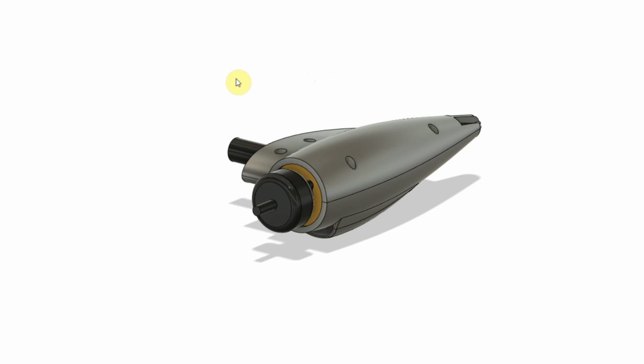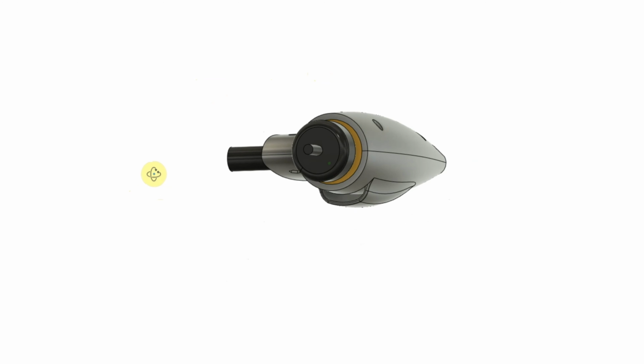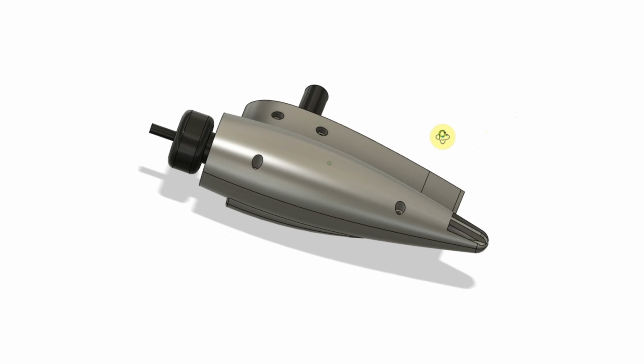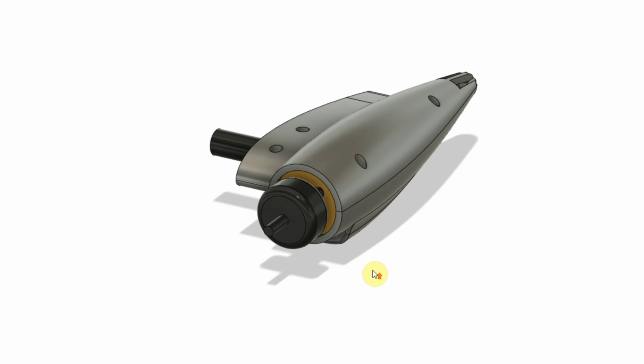This is the first version of the nacelle. Basically the way this works, we have a motor mounted here on a firewall in the front, and this particular version had an air inlet here and an exhaust back here for cooling, because I had intended to put the ESC in here as well. I figured it was a great opportunity for keeping the ESC cool.